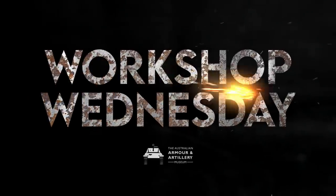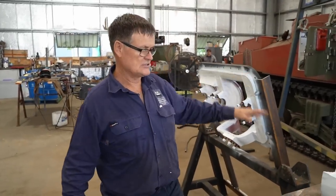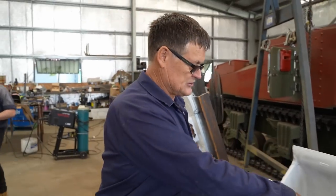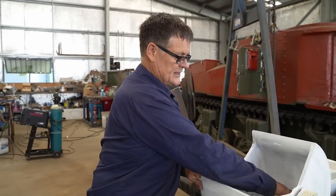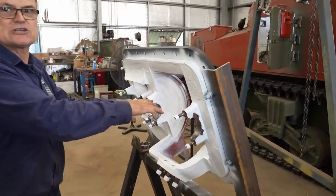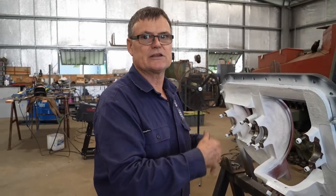Well, we're going to try to go at putting this 37mm gun together into the mantlet. This is the mantlet, and this is what we're calling the rotor. What we're going to get is Jess on the forklift, and he's going to put the forks through here, pick this up, balance it here, and we're going to maneuver it and wiggle it into this position here. And once that's in, that'll be the hardest bit, then we can put other bits in and keep working from there.